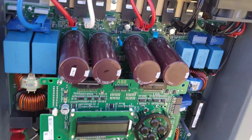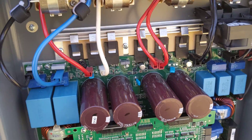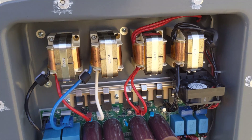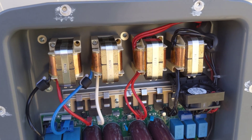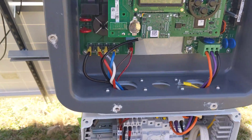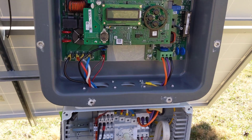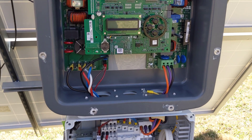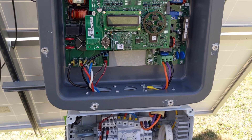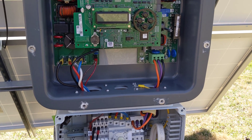Pretty neat. It's got some bulk capacitors — don't want to play with those. Then you've got your MOSFETs, clipped to the back heat sink. And up top you have a couple of large inductors. This is a dual-channel unit, so it has A and B input from the solar — there are two pairs of wires here. That way, say you have east-to-west orientation, you can have shadowing in the morning or shadowing in the afternoon and split the channels.